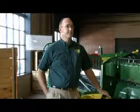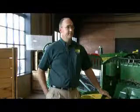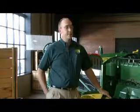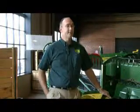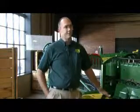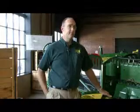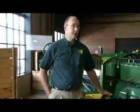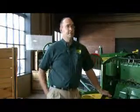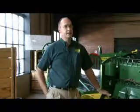Now, you said this is the most complete one. Yes. Of the 2 in existence. Are there any parts missing from this tractor? There are some parts missing in this tractor. There are some parts that have been removed out of the system but are still attached to the tractor just because they quit working and another application was put in place. Prime example is the fuel system. The vacuum fuel pump system was marginal on a good day. It has now been converted over to more of a gravity, so it's still on the tractor but is non-functioning.